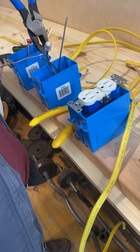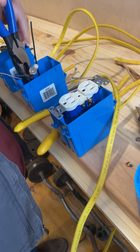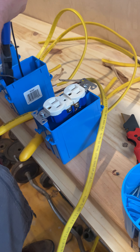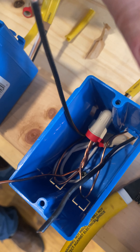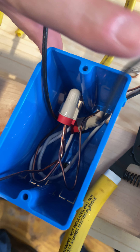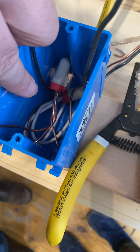Now take the bare copper — don't do this to the neutral because you'll hurt the insulation. All I'm going to do is stand my wire up, hold my other end so I don't catch it in the eye. Now look down in there — that's what we're going for. Is it going to look like that the first couple of times? No. But that should be what we're going for.